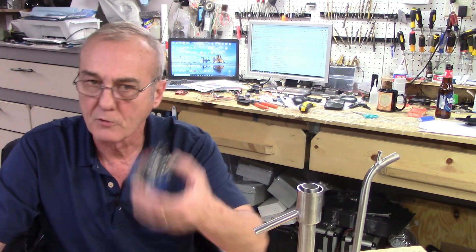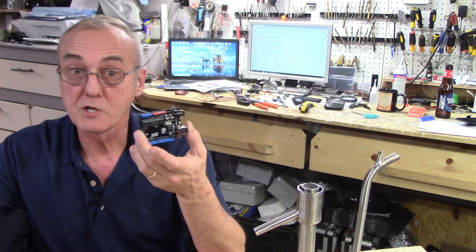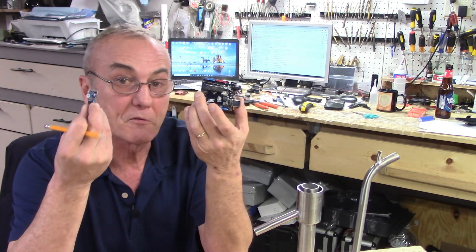Thanks to Mark and his mathematical genius, he was able to develop an algorithm — a programmable formula — where he plotted this on a curve and developed the conversion for different portions of that scale. Your time-of-flight sensor picks up the distance, it goes into the Arduino, and the program figures out the distance, the min and max ranges, which part of the scale you're on, and the conversion. Then it pulls the audio information off the SD card, sends it through the amplifier, and the speaker speaks — 'one hundred twenty proof.' That's how simply it works.